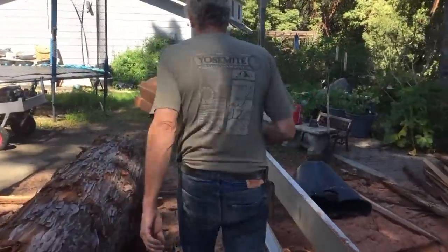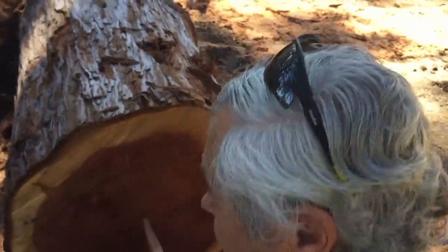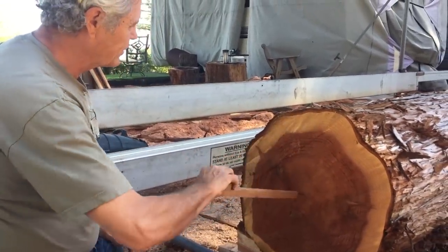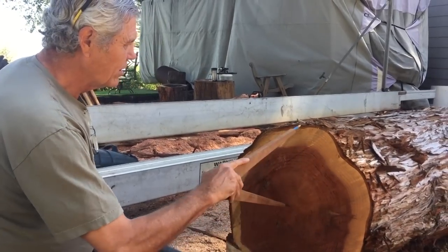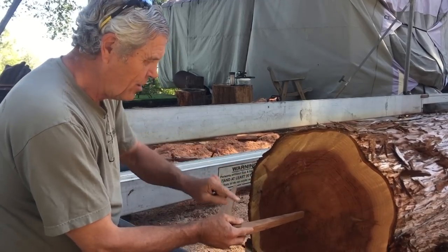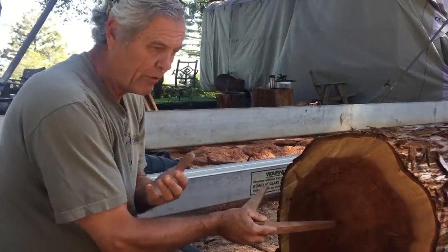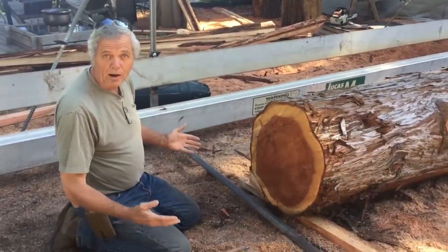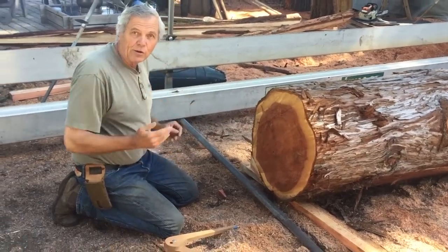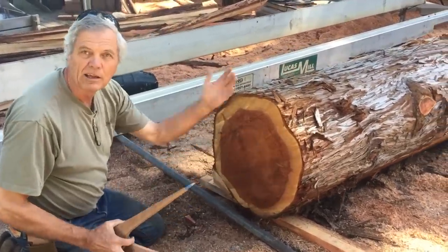There's the pith of the tree, which is not the exact center. What I'm doing is roughing in the idea of what a circle is on this piece of wood — I'm pretty close, a little bit off, but that's about as close as I can get. So if I take this circle and relocate it to that side — I don't normally do this, I just estimate — but this gives you a better idea of how to set the log up for milling. The best we can do is box off the smallest side of the log. Unless I'm cutting tapered boards that are thicker on one end and thinner on the other, you have to work with the constraints of the smallest piece of your log.